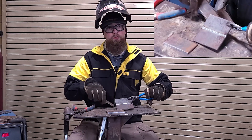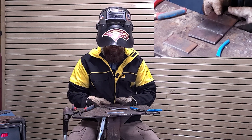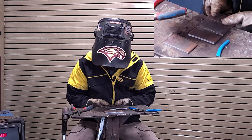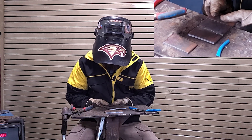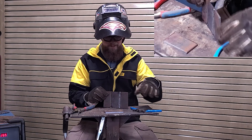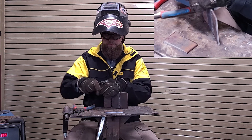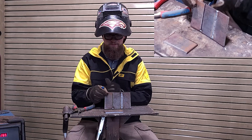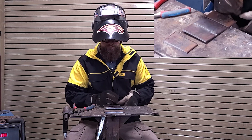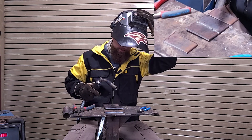Instead of cutting two new pieces, if you want to attempt another one, you can just tack another piece onto the edge of your current weld. I'm going to open this up again about an eighth of an inch, and use a pair of pliers or something to get that plate nice and even and consistent across and down. Now I have the plates flushed up with about an eighth-inch gap, so I'm going to tack it again.